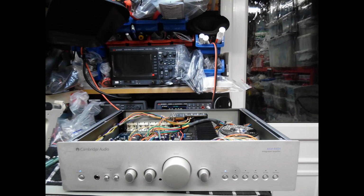So the reason why I mention that, and I have on previous tutorials, for repair technicians or people doing repairs, the nicotine which gets coated onto the circuit board also coats the user control potentiometers and internally the switches. And that means that you will have to spend a considerable amount of extra time just working through that, right? Because it just gets everywhere. And sometimes with the user controls or even the switches, it's just not possible to clean them internally. Sometimes there's nothing you can do, but you have to replace them. Thankfully, in this case, they didn't require replacing, but it did take quite a lot of extra work to get them to where they needed to be, where they were noise-free and reliable in operation.